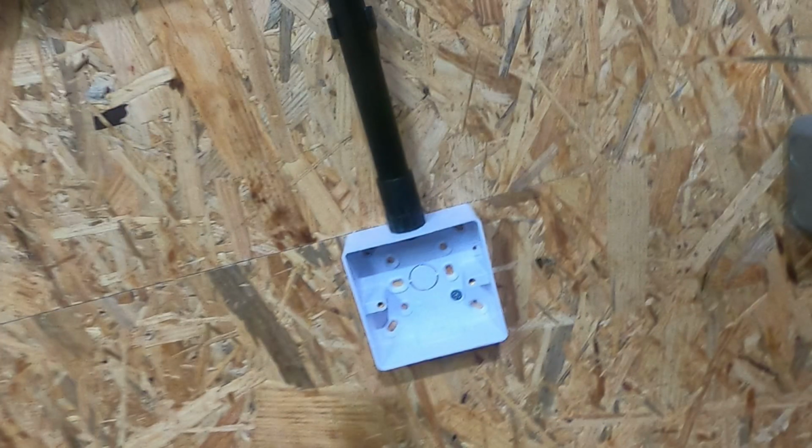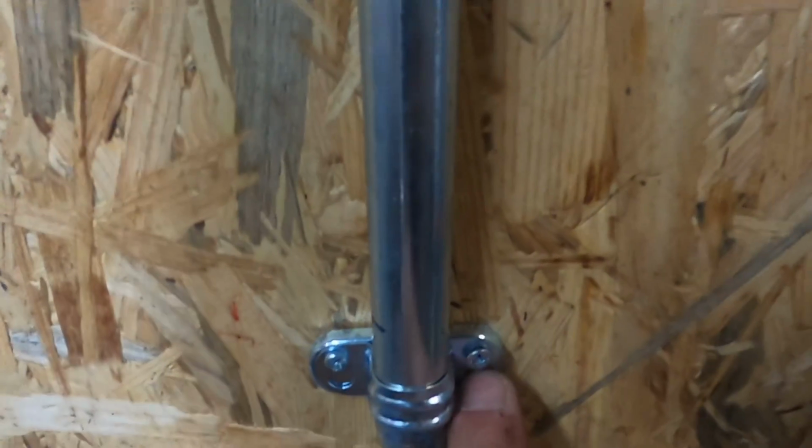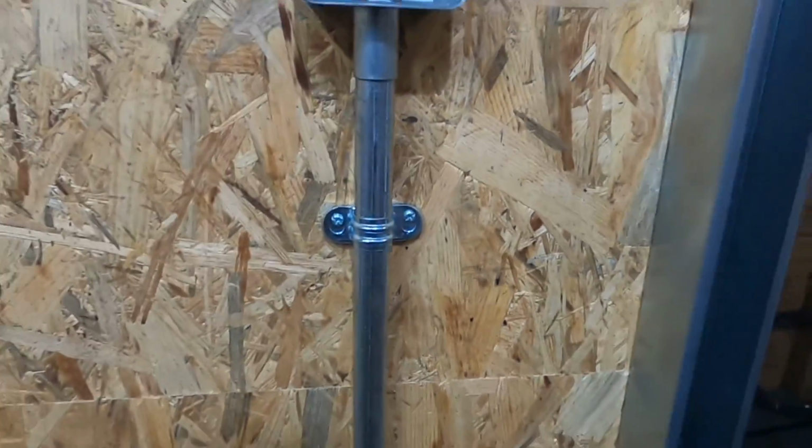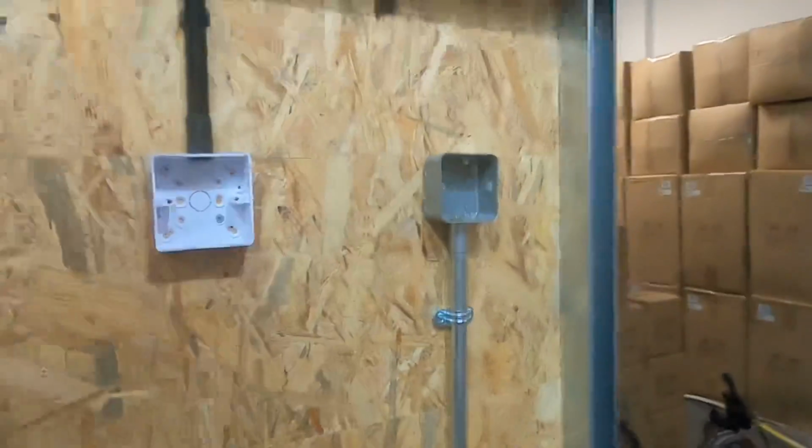So then now we have the 20mm drop down to this switch, which will be our intermediate. Right, we've got this 90 in. I lost that screw, so I had to put a screw in there straight through to the wood, which is fine. But doing industrial work for a demo board sort of thing, it reminds me why I like domestic. Cut my hand. It's a bit tricky sometimes if you don't do it all the time. So yeah, we've got that 90 and got the saddles in and ready to wire basically that switch.